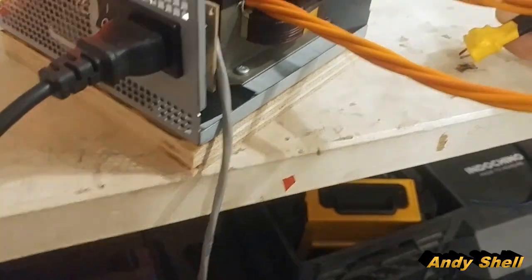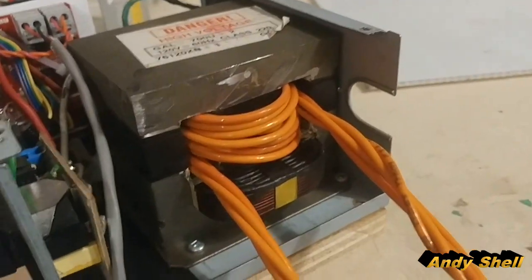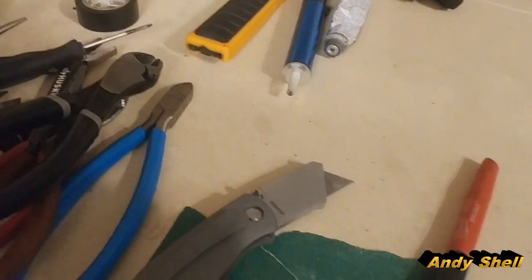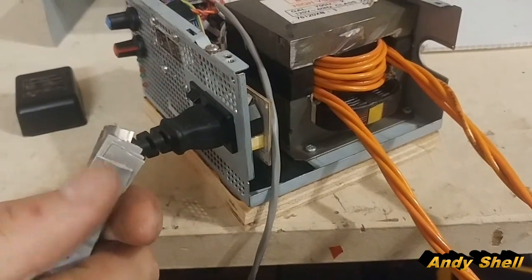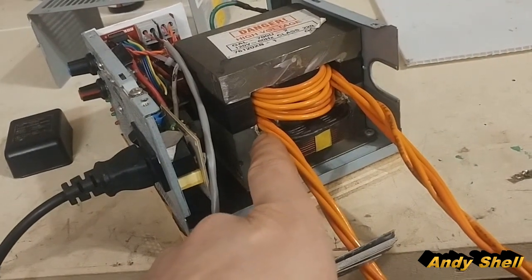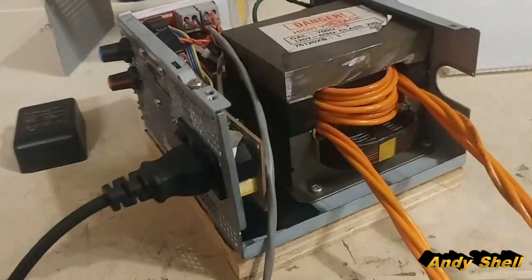While you're building, figure out your own way of doing it because this isn't necessarily perfect. You've got to be careful because you can blow holes right through your battery, so you can't set it too high. I'll link a video that explains how to build them much better. One part that was really helpful that he explained — and other people didn't — is there are all these plates of metal in there between the primary and secondary windings, sitting down in there, and you have to knock them out with a flathead screwdriver; otherwise you won't get very good performance.